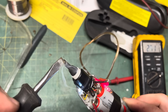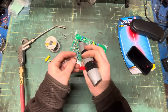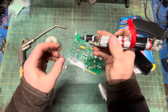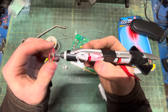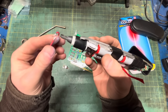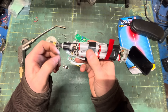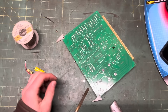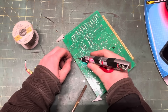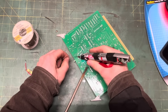I'm struggling to find a good application for this. If you need portability, get the Milwaukee soldering iron — or if it's 2004, buy a butane one. It's not really good for wires because you have to push so hard to make contact, and wires don't want to stay still and cooperate. I also wouldn't want to use it on sensitive components, as we've demonstrated almost 3 amps will be flowing through whatever you're soldering. I think I found one super esoteric application where this thing shines: de-soldering through hole-mounted components. The little nub sticking through keeps the slot in the soldering iron tip perfectly centered, then you can just push down on it and let the tool do the work.